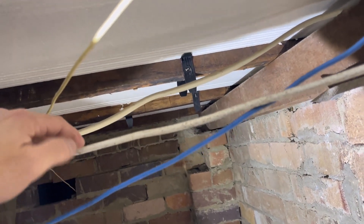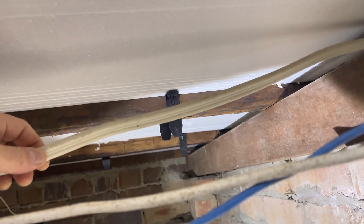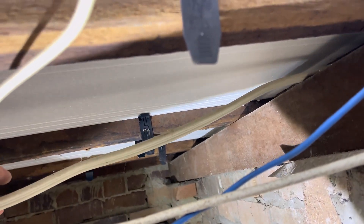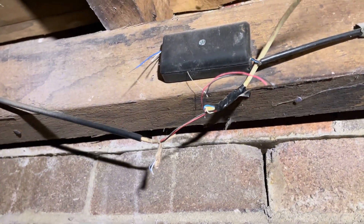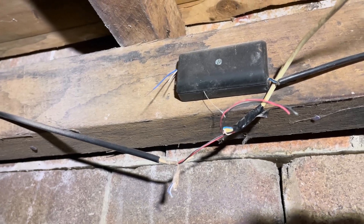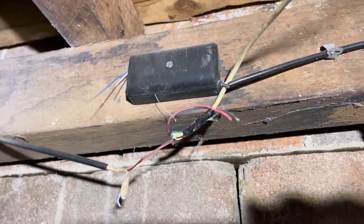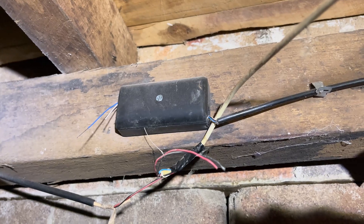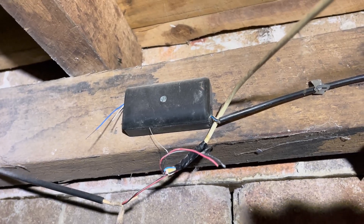When it was here before, the Sparky had it wrapped around this electrical cable, this twin-and-earth 2.5. They had it wrapped around that. There goes my light — now I've got to do the rest in the dark. Time for a headlight. So here I'm going to remove the leading cable and do a proper join, join everything back up. We'll see if that actually gets him out of trouble. I don't think it will — I think it's going to be the leading cable — but we'll check anyway and see what happens.